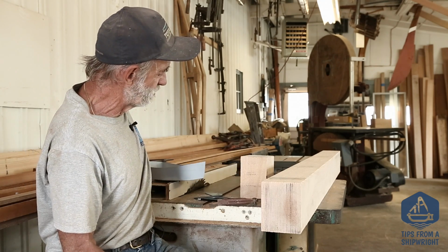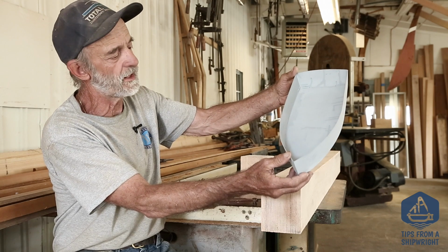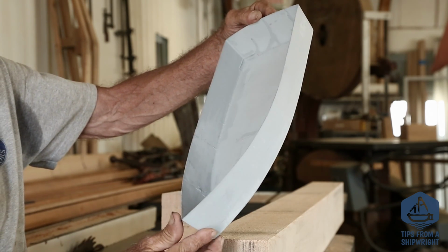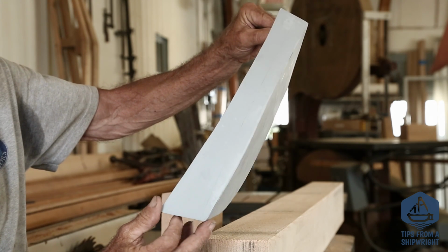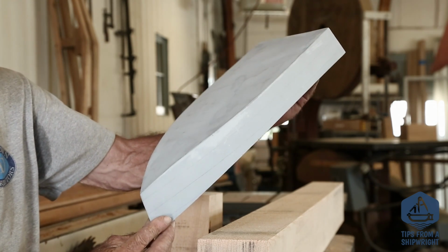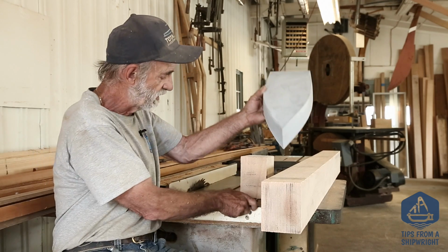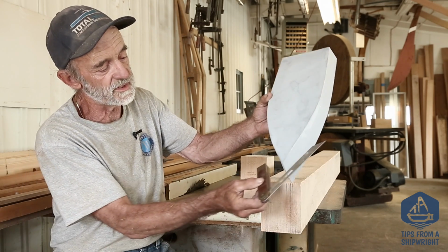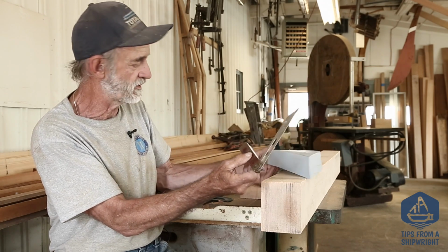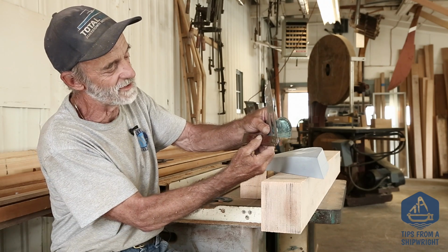The first thing I'd like to do, though, is show you a model of the skiff that I'm going to build. This was made in cardboard. I'm not necessarily taking my dimensions off of this model. I had to have my dimensions before I built the model. And one thing I know about these skiffs is that 60 degrees at the entry makes a very nice skiff. So what I've done is I've taken a bevel set and I've set it at the stem like this, and I've checked it on a protractor and found out that it's still 60 degrees just the way I built it.